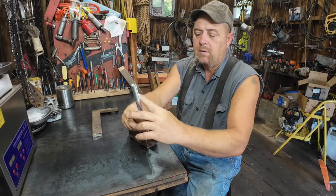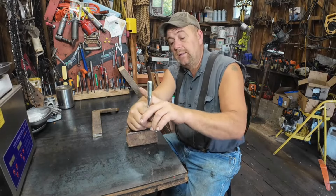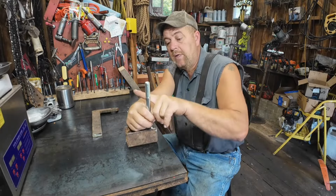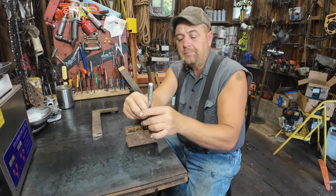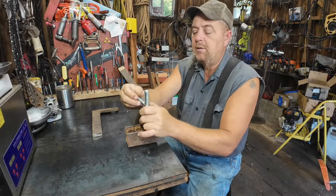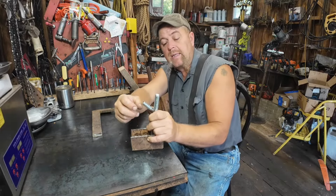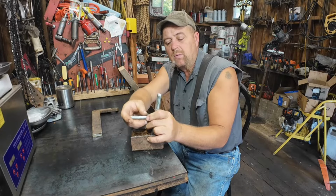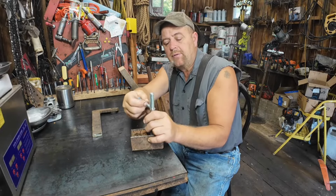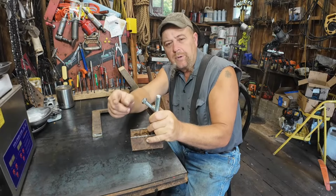You want it angling outward, away from your handle, right? Your handle's back here, you want it angled outward. So, and then I cut a groove in that. So this here bolt would lay in there, right? Now I'm gonna tell you, the voice of experience when I built my cant hook: don't lay the shoulder of this bolt in there. Lay the threads of that bolt in there. Or get you a longer one, just use the shoulder.